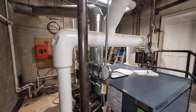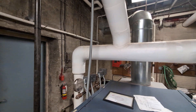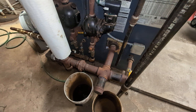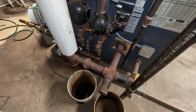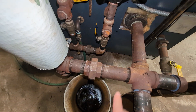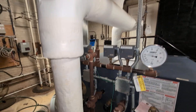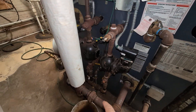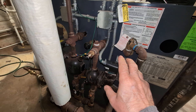Overall I would say that the install is not too bad. There's your outlet and they've got the correct number of swing joints. The Weil-McLain manuals call for stress relief fittings here, and as far as that goes, the installer in this particular case used a hardening pipe dope which doesn't allow for proper torque relief. The idea is that when the header is cold and the boiler fires, it begins to heat and expand, putting stress on the fittings, gaskets, and so forth.